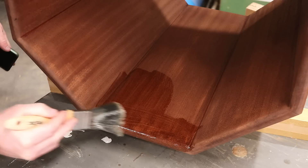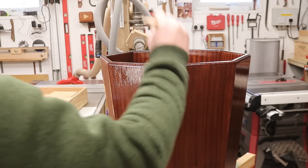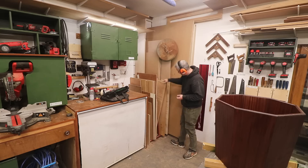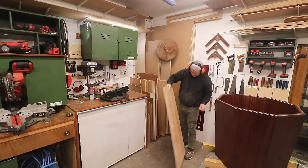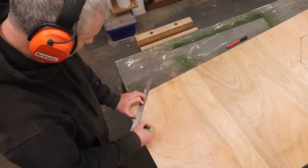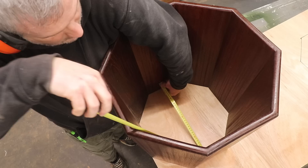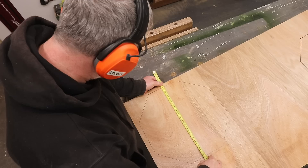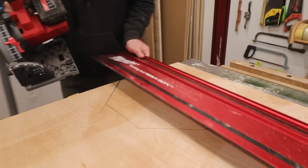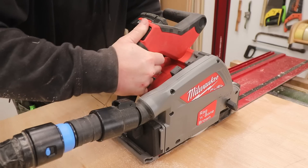After a couple of hours I started applying a coat of hard wax oil, and then I can let it sit for a few days until it's fully cured. Next I want to make a bottom for the basket so I pulled out a piece of 12mm ply and drew it around the inside of the basket. I actually want the bottom to be a little bigger so that it sits higher up, so I added about 5mm all the way around the perimeter, double checked the dimensions and it looked about right. I'm going to cut that 5 degree bevel, making sure that my saw is in the same orientation for each cut so that all my bevels are the right way up.